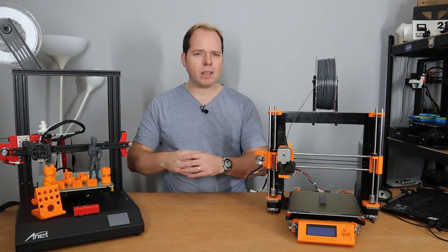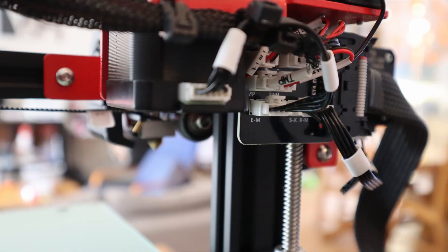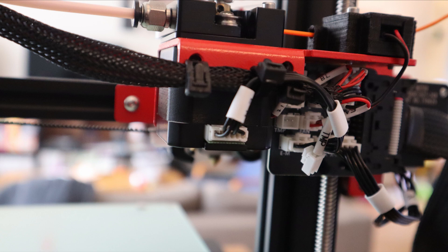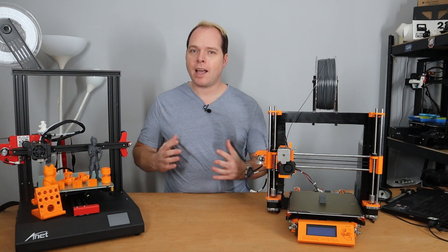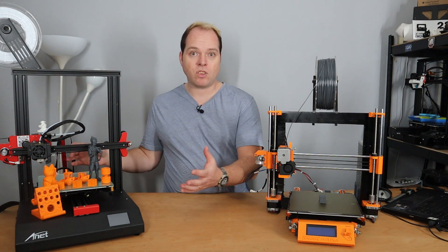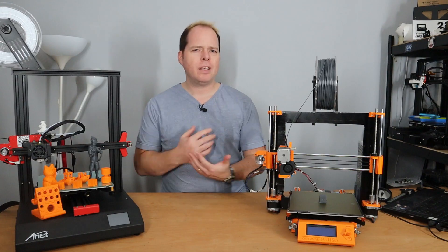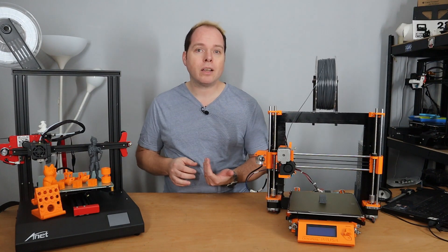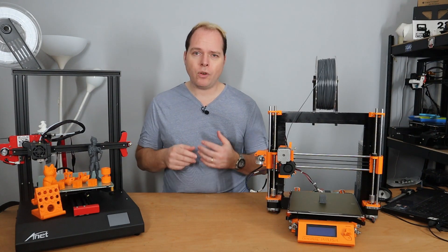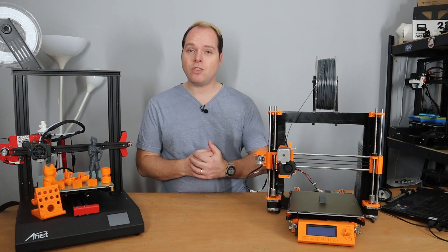Make sure that when you are going to assemble it, you read the instructions. Because I thought I connected everything the right way — I only flipped two cables, one for the thermistor and one from the auto bed leveling. And then for the belt tensioning for the Y axis, ANET used some zip ties to keep the belt in tension. Tensioning the belt for the Y axis is pretty straightforward: you loosen the screws for the Y-axis stepper motor, tension it, then screw them back in place — making sure the belt is in the right tension but not too tight.